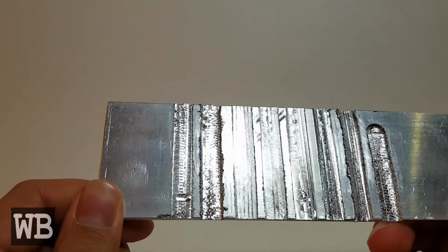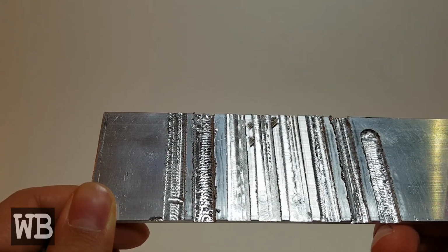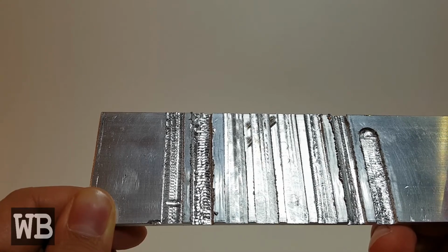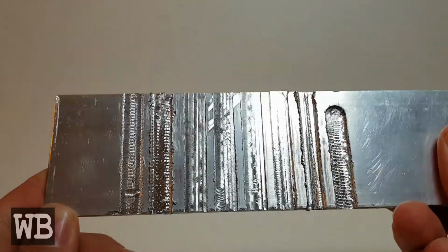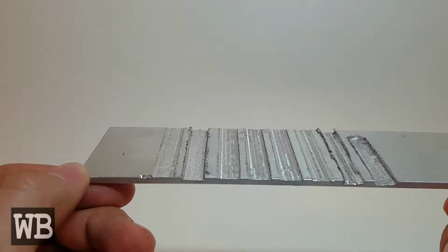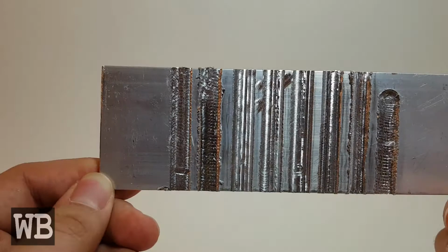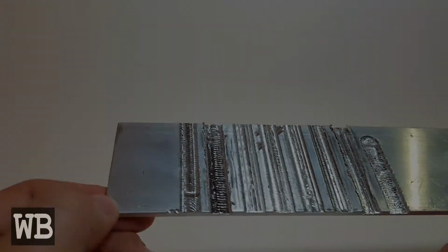Overall, I do not think this spindle was well suited for a single flute end mill, as it did not achieve a high enough RPM to smoothly cut the stock. It felt very choppy. I think a spindle with a higher RPM would be much more effective with a single flute end mill. In a moment, I will be showing some images on the screen of close-up pictures to give a more detailed view of each of the tests.